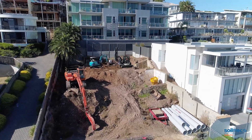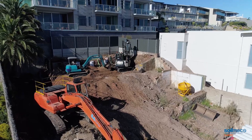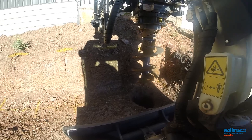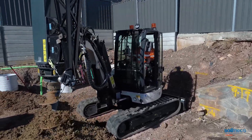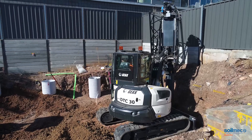When I started and once I had become comfortable in the machine, I found that the productivity of the machine is very, very high because the controls are so responsive — slewing around in and out of the hole, unloading the auger is a very, very fast process. On some projects I've been drilling in soft ground conditions, nine and ten metres deep in 20 minutes at 600 diameter. Then on other projects we were drilling some limestone for a retaining wall contractor and we were getting about four metres an hour in fairly firm limestone material that a five tonne excavator with an auger attachment couldn't drill at all. Most days I'm putting six to ten holes in up to 10 metres deep without any hassles whatsoever.